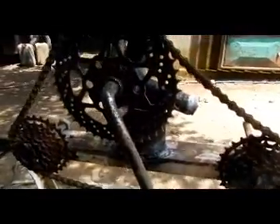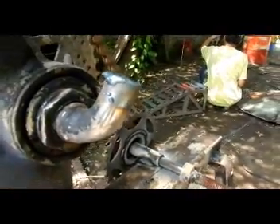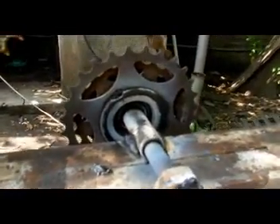So that's readily available — secondhand angle iron. All we've simply done is use the chain off this old bike, which was long enough to run from this cog to that cog and back over the main sprocket, and cut off one of the arms so that's out of the road. On here we'll weld some hooks — here and here, and one here just for fun. All you've got to do is spin the pedal; there's a handle already made on the pedal. What's important is these cogs are exactly the same sprocket on both sides, so that these rods spin at exactly the same speed. Otherwise if it was one large and one small, you'd end up with one rod spinning faster or slower than the other one. So they've got to be exactly the same.